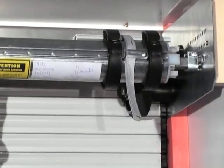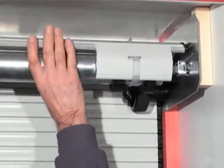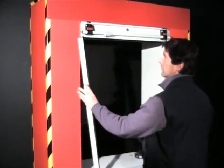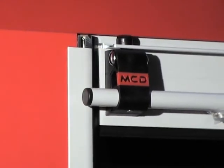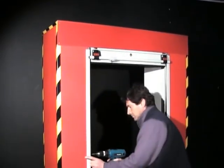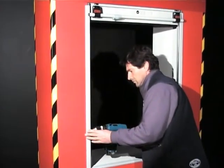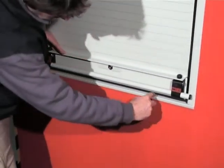At this point, you can put the roller under tension by removing the blocking fork situated at the far end, then gently roll up the shutter. You may now install the tracks. Identify the right from the left and slide them so as to have the groove opposite the side panels for standard tracks. For overlapping tracks, do the same while conserving the groove just above your header. Fix them onto the mounting of the opening, taking care to use countersink screws so as not to hinder manoeuvres.